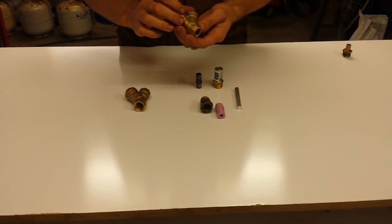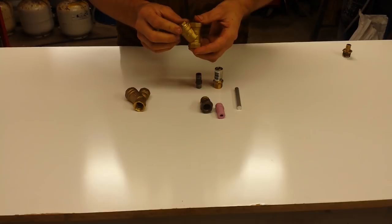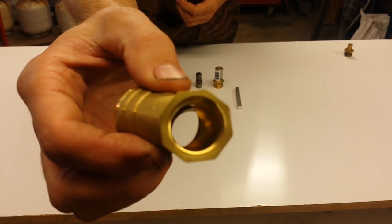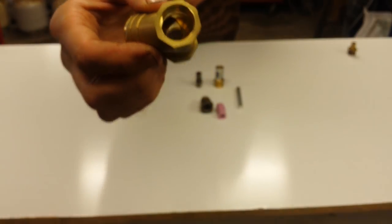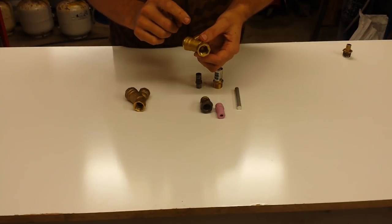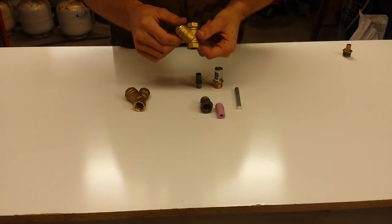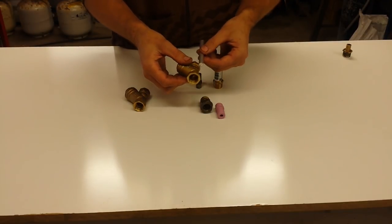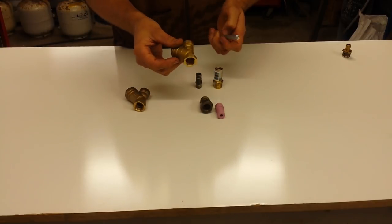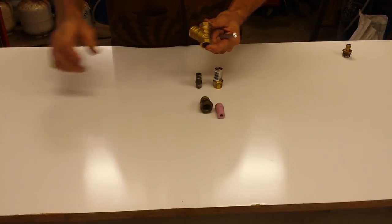This one here is a Chinese copy design - it's a lot lighter, less material in it, and the casting isn't as high quality. But for this task of building these vapor blaster nozzles, this is probably the better one. You can see inside there - there's still that deviation in there to direct water up into the basket. I've already removed the strainer basket from this one. There are a couple of things we have to do first: that deviation has to be filed out or milled out to ensure the rest of the unit fits together centrally.